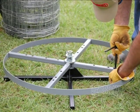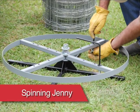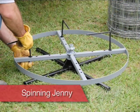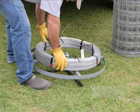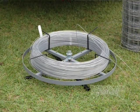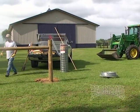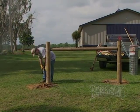Another tool that's valuable in the installation of H-bracing, or bracing in general, is a Spinning Jenny. These can be located at your local Ag Supply store, or found on redbrandgear.com as well. It basically holds the brace wire. Brace wire is normally a 12.5 gauge high tensile wire. Installing brace wire is the last component to build in an H-brace.